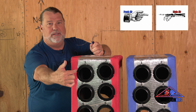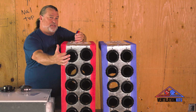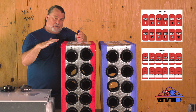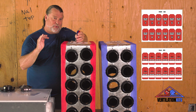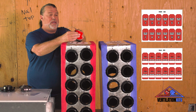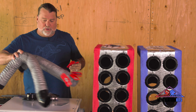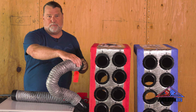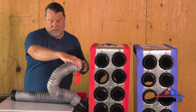And it's number-coded. The numbers are then on a chart called the port chart, and the port chart tells us which rooms these tubes go to. So for instance, when we install, we would have 2 tubes. We would put our numbers on the tube, put it into the correct port, and a number on the other end that would then correspond with a number that's on the diffuser in whichever room it is in.